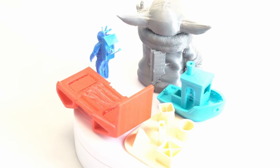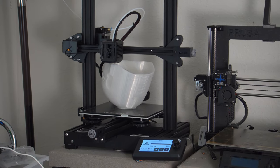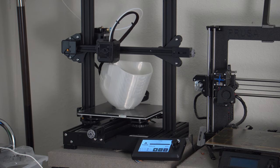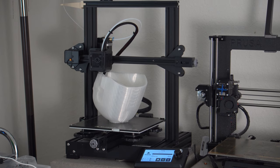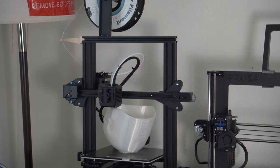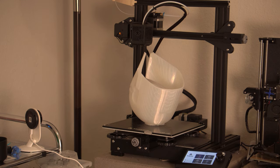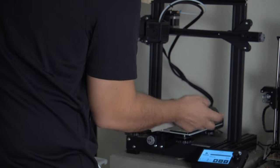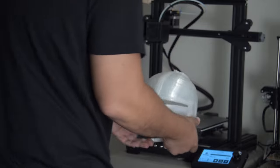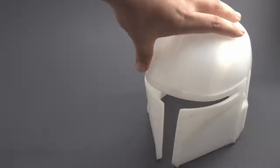One other really nice print I was able to do was this Mandalorian helmet. I printed this as large as I could fit on the build volume, so I had to scale it down to about 67 percent. You possibly could get a little bit larger, but not by much. This thing took 32 hours to print. This is a fresh roll of clear PLA filament, and look how beautiful this filament turns out — it's 3D Solutech, I'll leave a link in the description. It just pulls off of the build plate super easily. I printed it upside down so it would require less supports, less material, and go a little bit faster.